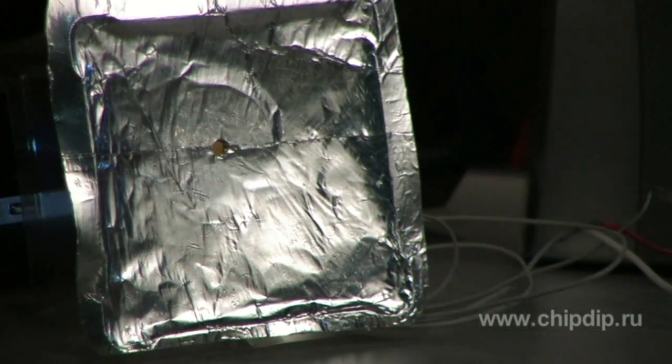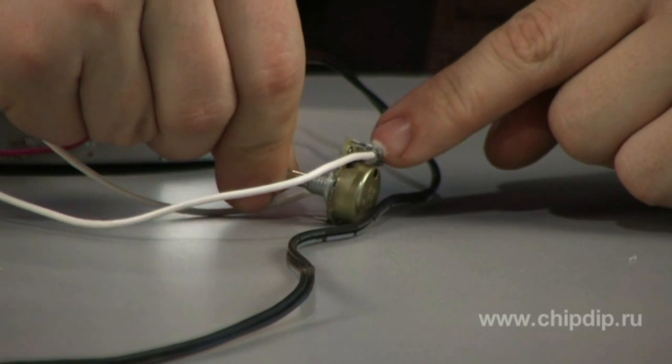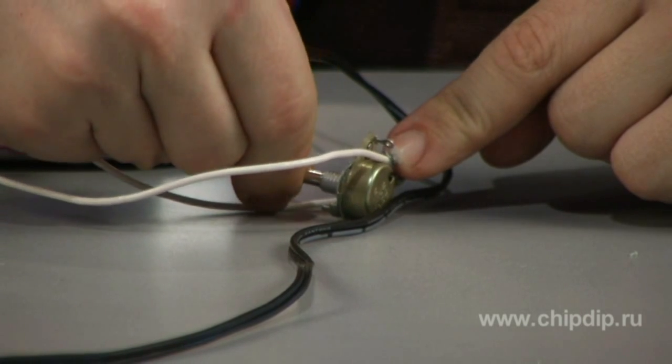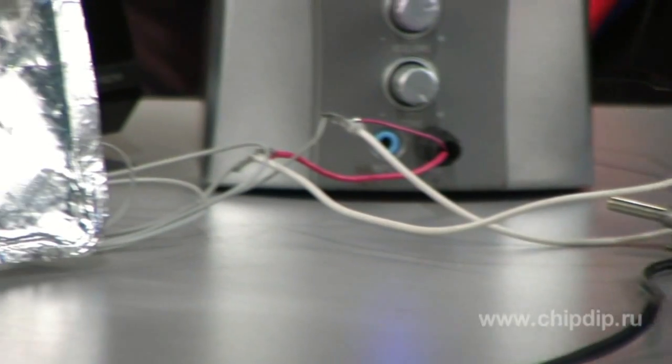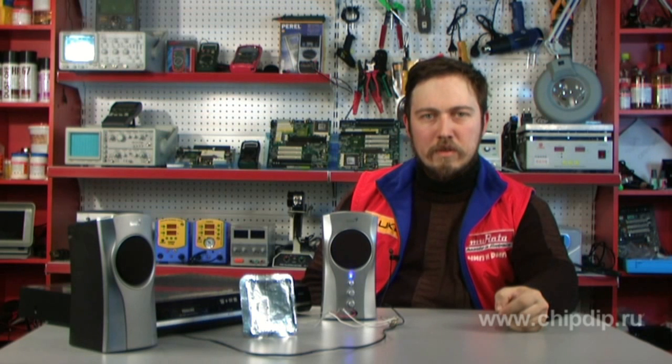A particularly convenient feature is that its DC resistance tends to infinity, therefore it can be included in the output stage of tube amplifiers without a transformer, bypassing a resistance equal to the calculated anode circuit resistance of a tube. The main thing is that the alternating voltage at the crystal should not exceed the maximum allowed — for the ZP3, that would be 5 volts.